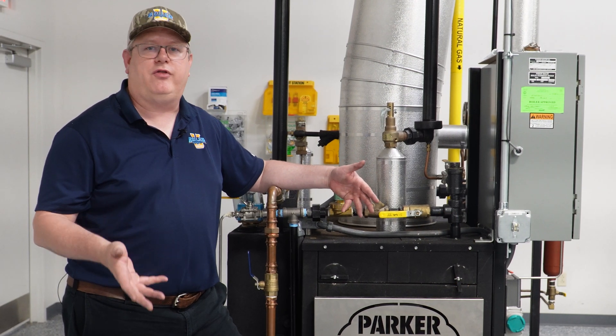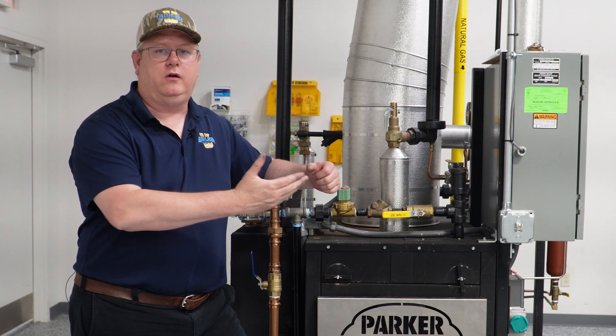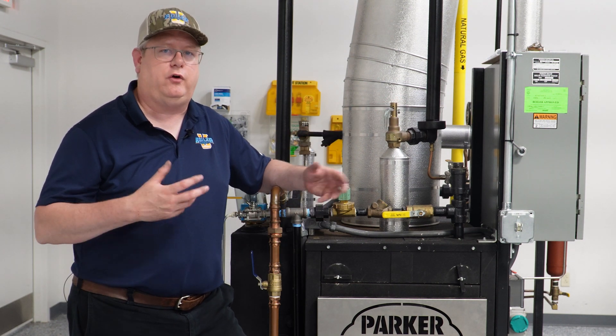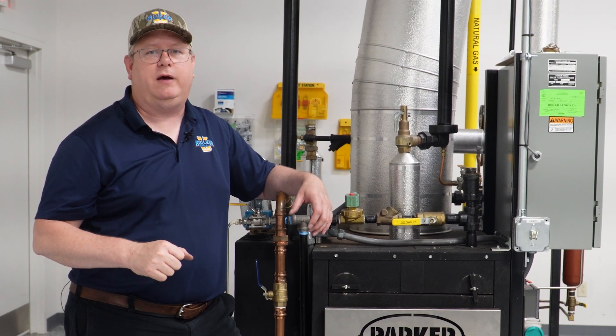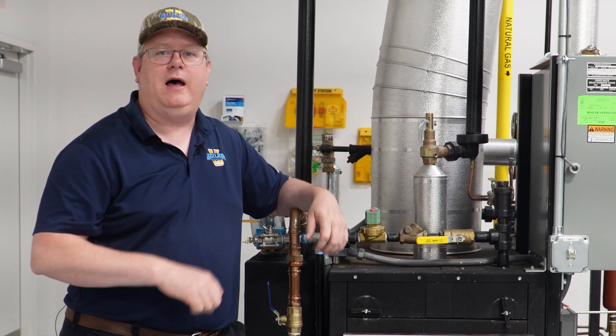There are different schools of thought. Nowadays, with modern shipping, readily availability of parts, and good testing and recertifications available for relief valves, it's not uncommon to just operate a boiler through the year and to change out and have the relief valves recertified annually. It's going to depend on your insurance inspector ultimately, but in many areas that's an approved method.